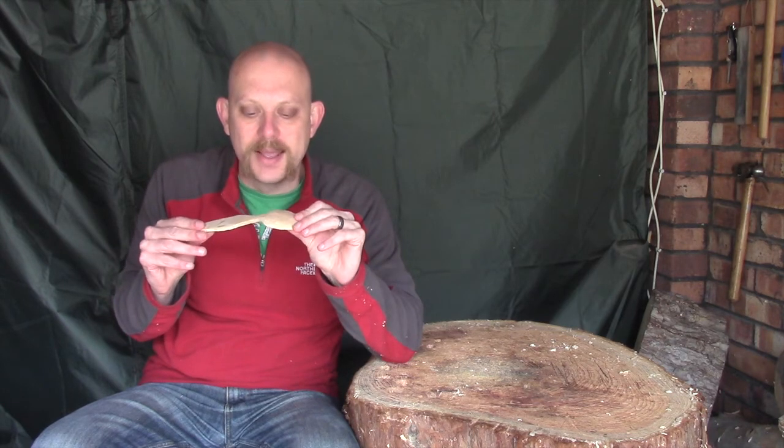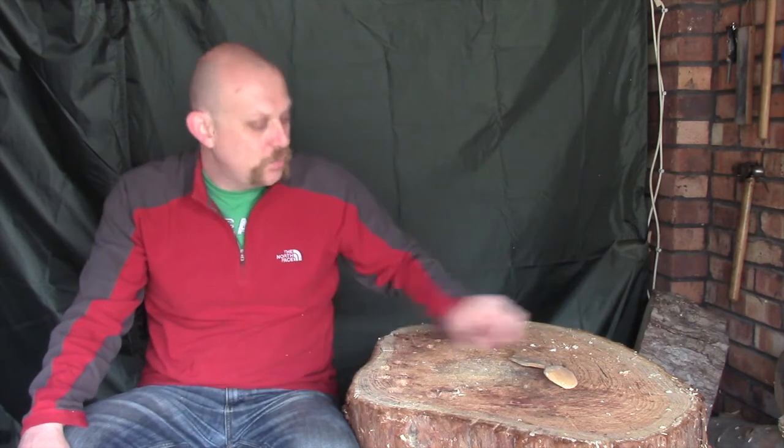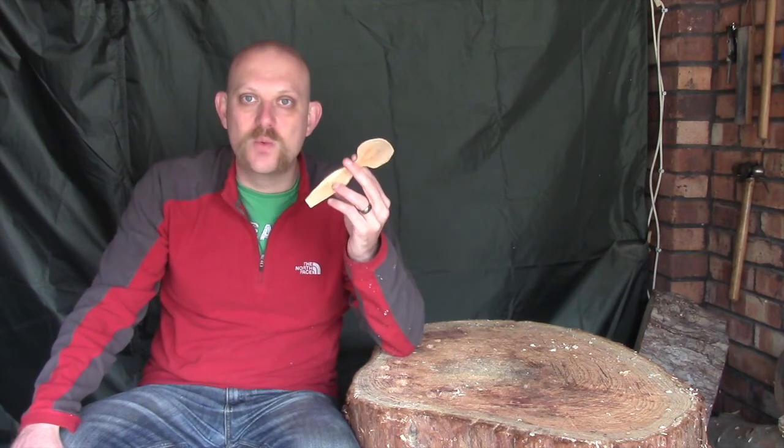Just feeling this now after the 10 minutes or so I've had it outside of its plastic bag — I can feel less moisture in there. I'm going to leave it out of its plastic bag now. I know that's contrary to what I usually advise, but because this is so thin and there's certainly not a great deal of moisture left, I'm going to leave it on my workbench for another few days, maybe a week. Don't take it indoors — the air inside a house is usually a lot warmer and drier, especially here in the UK, and that will increase the risk of splitting tenfold. I've had nice spoons and bowls I thought were dry, brought them indoors, and a great big crack appeared.